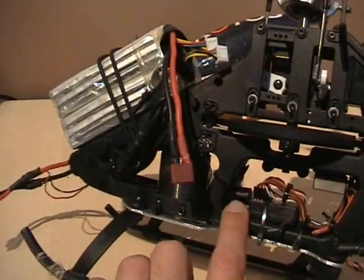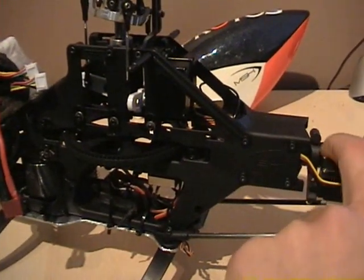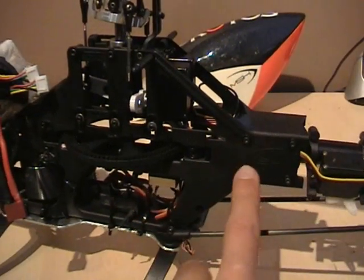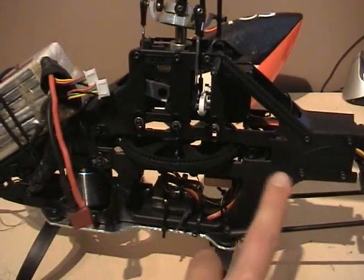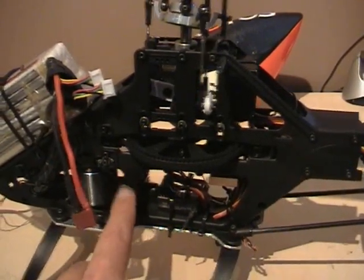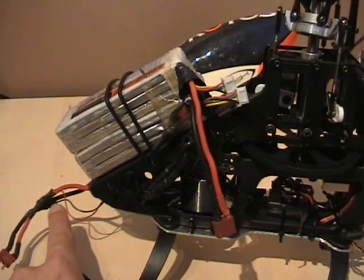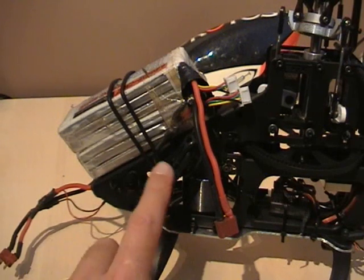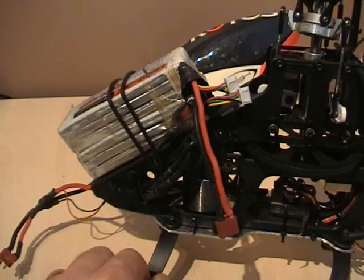That extra wire runs to my LiPo alone, so you can ignore that. Basically the negative wire runs from the boom, clamped and sanded in there, and can run to the frame here or the frame here — should be about the same since the frame is conductive. You can go one further if you want and ground that to the negative side of the ESC. That's going to fix it for sure. You don't have to go that far — most guys are just going to the frame. Hope that helps. Thanks.